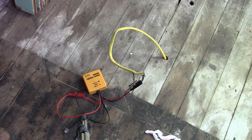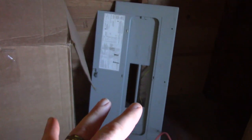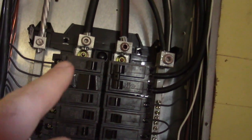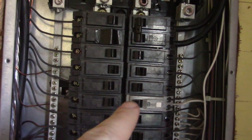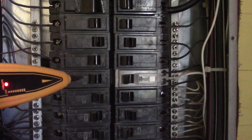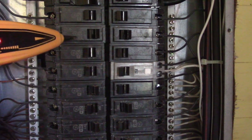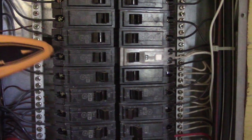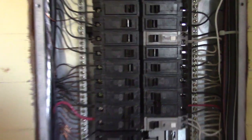We'll go into the breaker box and confirm it's on the correct circuit. The cover is off — mine is labeled dishwasher, number 11. The way this circuit box is laid out, breakers count down one, two, three, four, five, six, so odd numbers go one, three, five, seven, nine, eleven. You can just touch the front of the circuit breaker — you don't have to go to the wire. I've just verified that is circuit number 11.